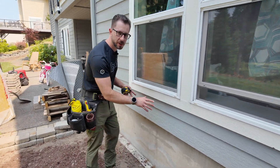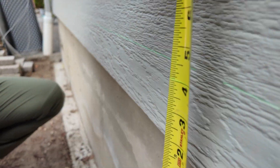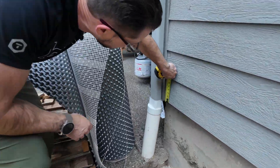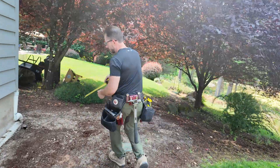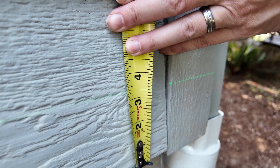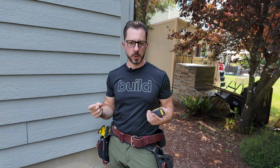The first thing we're going to do is just see whether or not our siding is level. So I got a Dovo laser. It's a little bit faint, but you can see that it's three and three-eighths, or six-sixteenths. If we come down here to this corner — what we're doing is seeing if it's sagging — that is just a smidge over three inches. For that ledger, we need, according to the mason, about three and three-quarter inches.